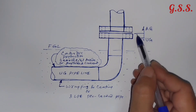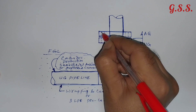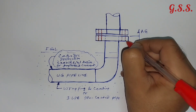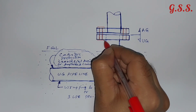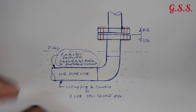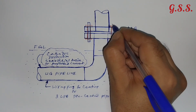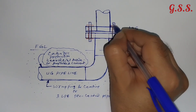So we will have to make this flange joint electrically isolated. To do this, we have to provide a GRP G10 sleeve like this. Then a phenolic washer is provided. And then a metallic stud is provided through this GRP G10 sleeve. This is the metallic stud.